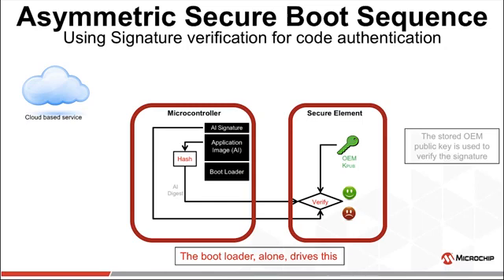Now let's get back to the public key. Public keys are not secret — they're open to everyone — but the OEM public key needs to be secured and trusted, as it is the basis for this signature verification. If an adversary has the ability to change this public key, any security has been completely compromised. Even though public keys are not secrets, this one needs to be secured. It's still not a secret; anyone can know it — it just needs to be protected from being overwritten.